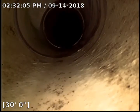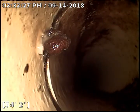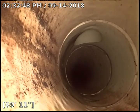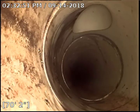This looks like it's going to either be a clean out or a vent. It's going to be a fairly long sewer, so we're going to have several fittings in here where different sections of pipe are connected together. It's going to be just totally normal. That's going to be another sink tying in or a laundry. You can tell by it because it's 2-inch.